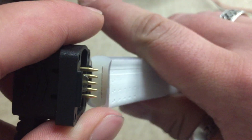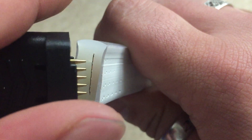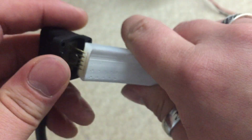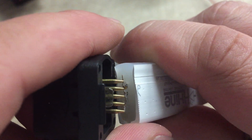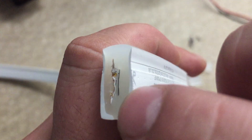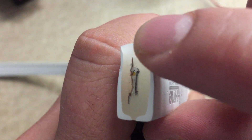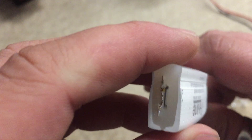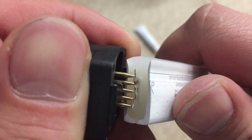You can see straight away that when I try it this way, that's the wrong way around — it's not going to work. The lip's not going to match up and the pins aren't going to end up on the bottom of the PCB and won't be able to fit in. So we take the other side — you can immediately see that's going to fit in perfectly. Note the damage that I've done to the PCB in trying to connect these. It's why it's always best to over-order about a meter — play around with it, make sure you get the hang of it before permanently installing anything.